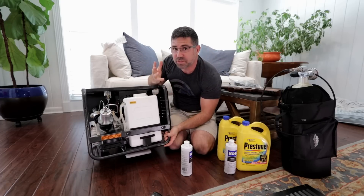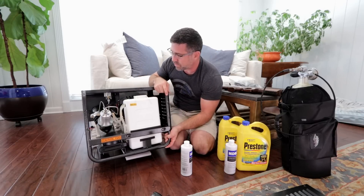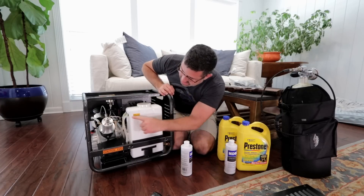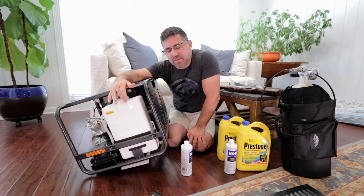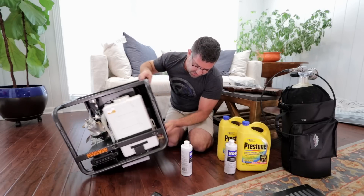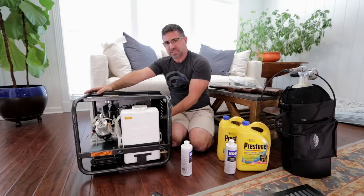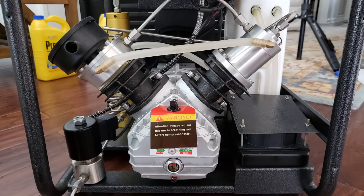Here's the cooling reservoir — as I said, it holds five liters. You can put distilled water or coolant in there using the dilution ratios we already went over. It looks like the cap has been taped on probably just for transport, but it comes empty — this is where you'll fill and maintain it. There's a max line here — don't exceed it. There are service intervals in the owner's manual, something like annually or every 50 hours, and there's a simple petcock-style drain on this side where you can drain the water out of the coolant.